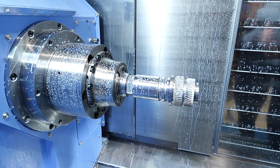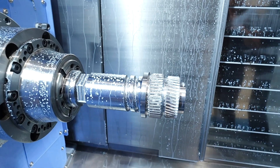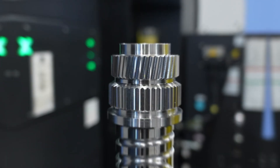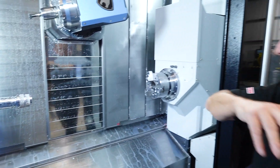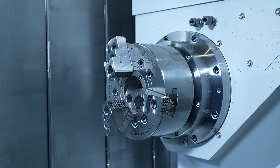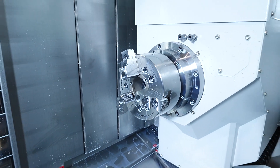This part here has got lots of different machining operations that have happened, or will be happening on it, to complete the component. The whole principle is about machining it in one hit. We have two spindles — the main spindle and the second spindle, which does the second operation. This currently has a chuck on it and will receive the part to finish the second operation.